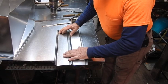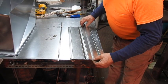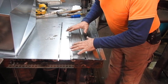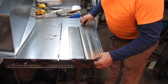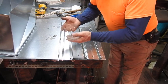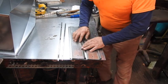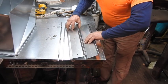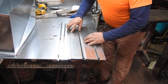Now we go about finding the 3/8 square rod. I went ahead and got the 3/8 shaft and drilled holes where they need to be so they mount perfectly in the center of the actual dampers. Make sure you mark the dead center of the metal before you fold it so you know exactly where center is to place the shaft. It's critical because we're using one actuator — we have to make sure this operates in a clockwise-to-open manner, just like the other dampers the actuator is connected to. With these interlocking this way, the overlap is in the correct direction — clockwise to open, counter-clockwise to close.